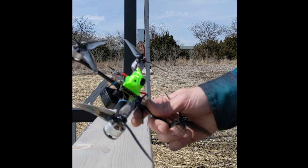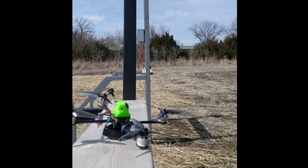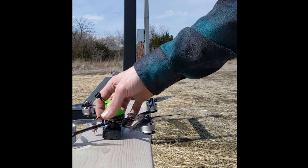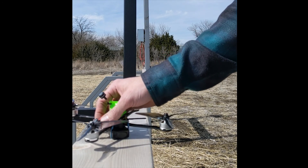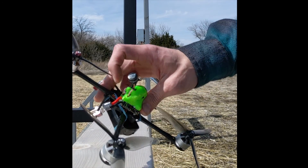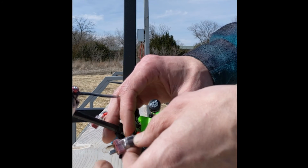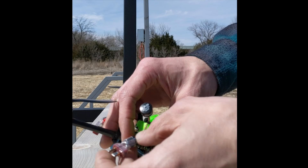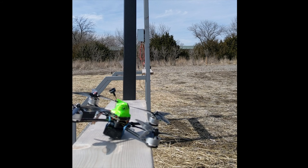Currently we have a 5S high-volt pack on here. I had a funny conversation with the BetaFPV guys — they told me do not run this on 6S. They said the power cable and capacitor from the factory was not able to handle 6S voltage, so I went ahead and upgraded it. I don't have the correct capacitor yet, but I did upgrade it to 16-gauge wire and a Dean's plug to get a few extra amps out of it.